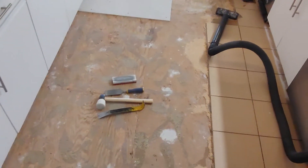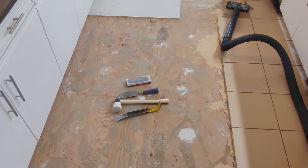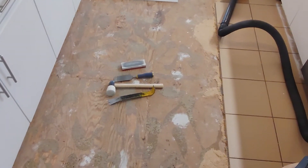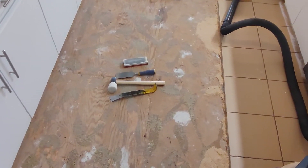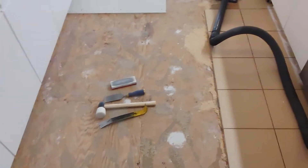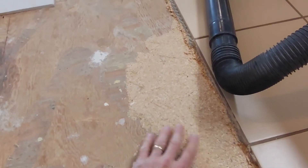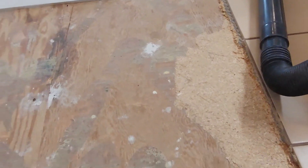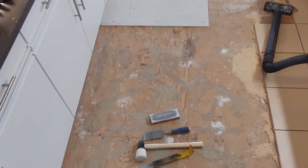Probably if you're a builder, you're just going to pull up the subfloor and replace the subfloor. If you're a more serious professional and you can handle the dust, I would recommend an angle grinder with a wood saw attachment for getting up the little bubbles of particle board — this piece here has glue under it.